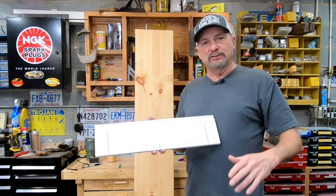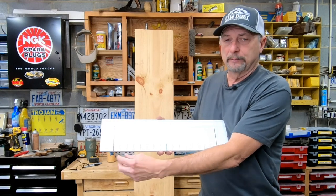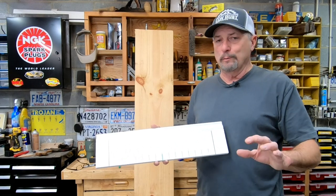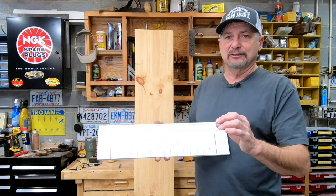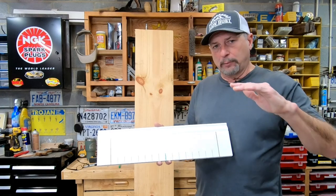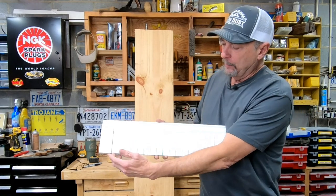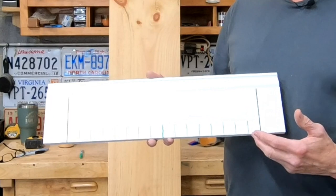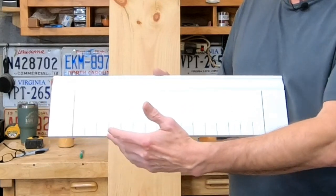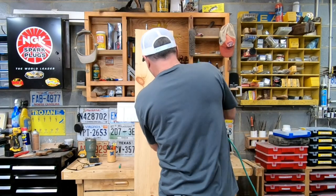The first level you need to know: these are called sixteenths. There is another measurement in between, but most carpentry or drafting won't use a thirty-second — maybe some extremely fine woodworking or machining with really tight tolerances. When we're talking about residential or commercial construction, we're talking about the imperial scale, the standard scale, and it's made of 16 sixteenths. We'll stick this on the board so you can follow along.